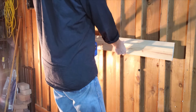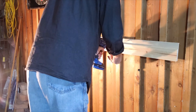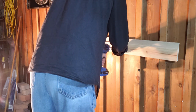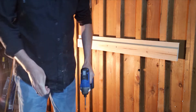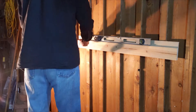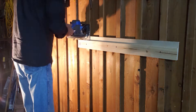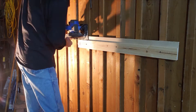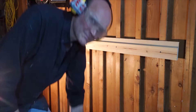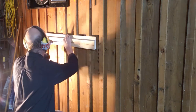All I've done is taken a piece of half-inch plywood and a three-quarter inch piece of pine and screwed the pine to the plywood. Then I took that small circular saw and ran it with the fence along the pine so it would cut the plywood at the exact width of the shoe — sort of making my own little track saw. I can screw it to the wall and run the blade along that track to cut the battens, adjusting the blade depth so it cuts the battens and not the wood behind it. Once the first section is done I move the track over to the next set and keep going until all the battens are cut to make space for the shelf.